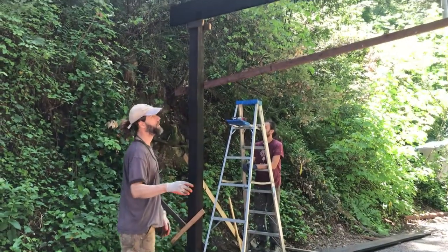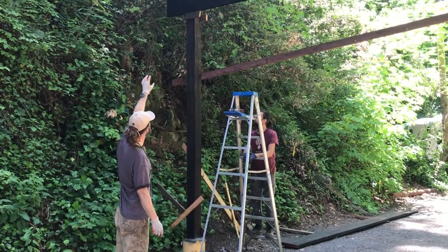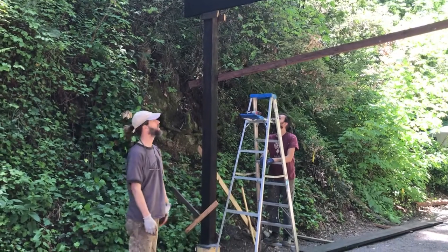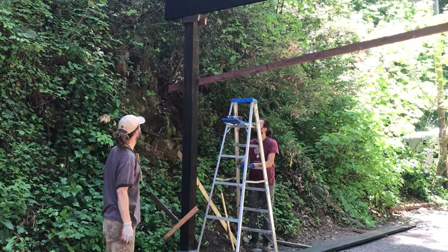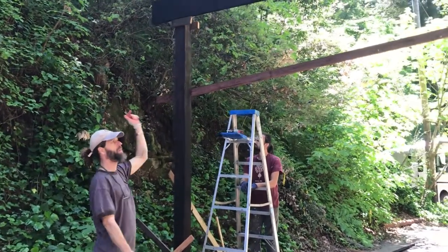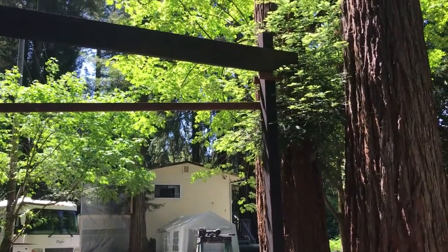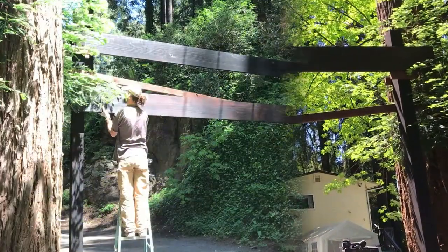At this stage the important things to note are: I measured from the top down the width I wanted the post to set on the bottom, then I put on the 2x4 scabs — those are really critical so that when you stick up the big board it sets on top. Once I put the 2x4 scabs on this side, I put a laser level on top of them and shot the level over to the other side to make the same marks. Now we have a perfectly plumb and level entry gate.